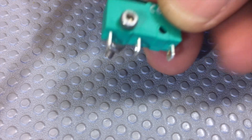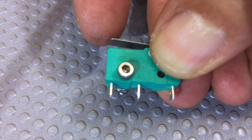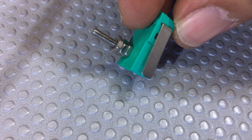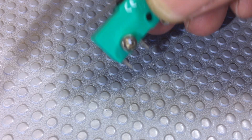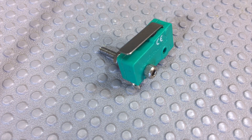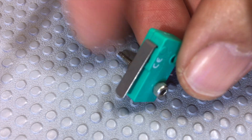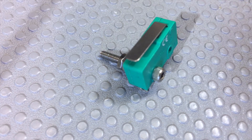I figured I could fit this in like that, and that would be the lever over there. Putting this bolt through here — I've actually put three nuts on here, and the three nuts give me the height I need off the chassis to put that lever at the right position where the wafer will come back and activate the plunger. Then on the other side of the chassis, on the top side, this thing goes through that hole and I can put another nut and a washer, probably a lock washer, and see if this works.